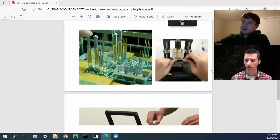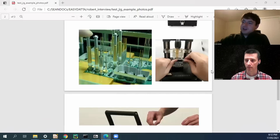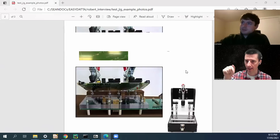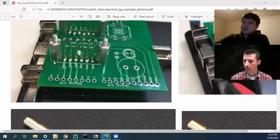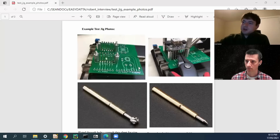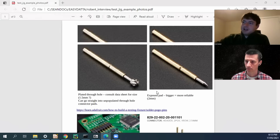How do you connect these needles? Because I've seen them soldered directly to the board. I personally prefer to solder them in. You make what I call an interface PCB and just go straight at them with solder — that's probably the best way. Some old-fashioned places will actually run a line directly off the test pin and do it by hand, but that's not advisable. You do want to make an interface PCB.